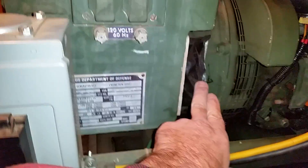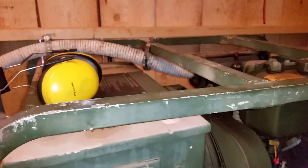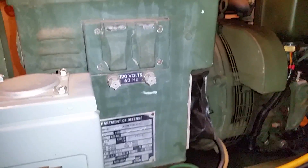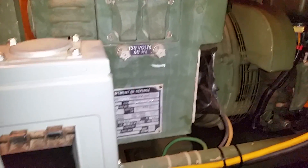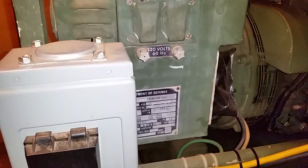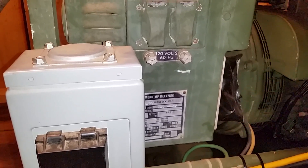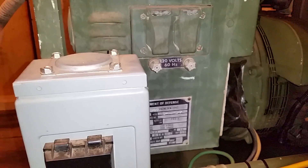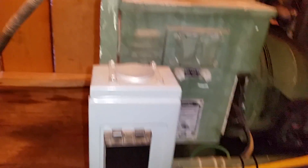There's only one circuit coming out of here — it's all one circuit, because there's a rotary drum switch under this lid where you can set it for 110 power only. The full potential of the generator is on the one circuit, and the generator is still balanced. That's critical when you've got a setup like we have. If you had just plugged in a regular generator that doesn't have a 110-only position, it probably would unbalance the generator and burn the coils out.